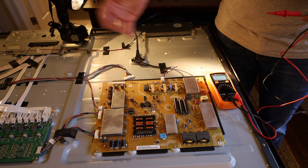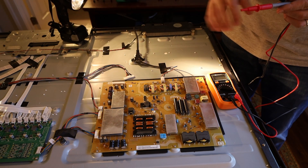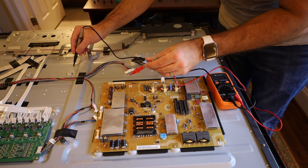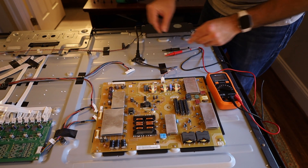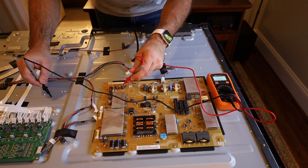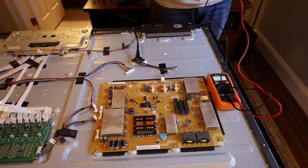I'm going to disconnect all these other cables to see if anything else is influencing that reading, and just keep the external power connector in. I want to see if it still reads the same with none of the other boards connected. TV's plugged in, negative on the chassis — you can see it's jumping from about one and a half to five sometimes, but it's not a steady 5, which is what it's supposed to be.